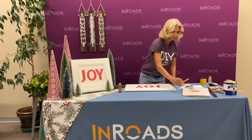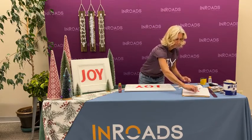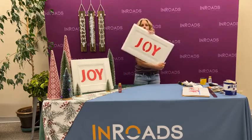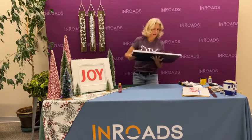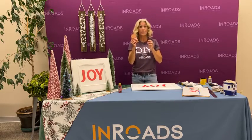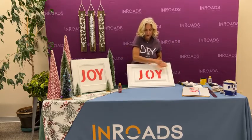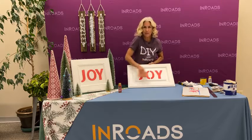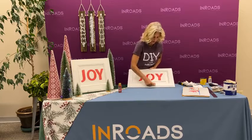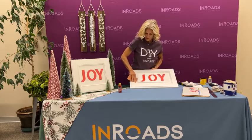Okay, so look at that rolling like that. Okay, so like that. And then it needs to dry, and then when you're done, like I said, you used your 150 or 100, and you're going to sand this one direction, all the way across like this. Now, if you also wanted to, I like to go around, and you'll see it. You start sanding around the edges